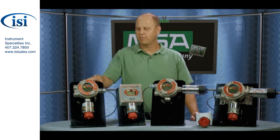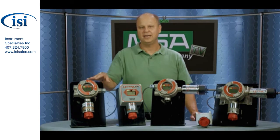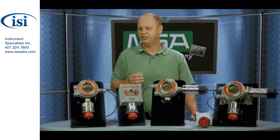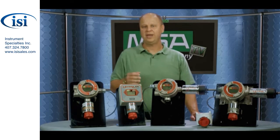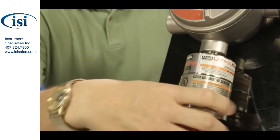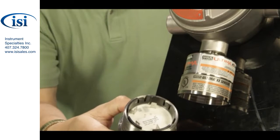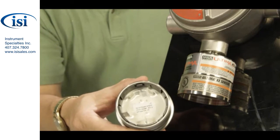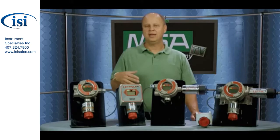The next thing we want to talk about concerning this product is the sensor itself. The sensor is an easy-to-screw-out sensor where you can take the sensor off of the housing and interchange it with another sensor in the field. A really great, cool feature of this — and it's also a patented feature — is that you can disconnect the sensor under power. Basically, you start turning out the sensor, and at some point you'll get to where the sensor itself is no longer powered but is still connected to the product. Once you remove it a little further, you can remove the sensor under power. There's really no need to declassify the area or unpower the sensor itself. You can do this on the fly in the field.